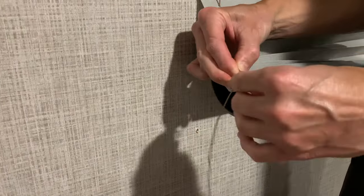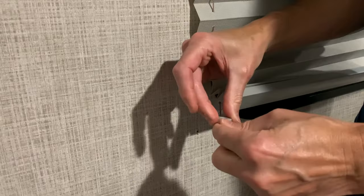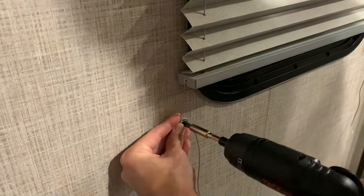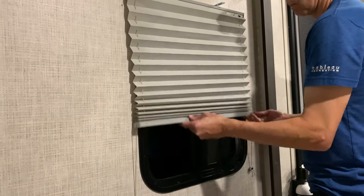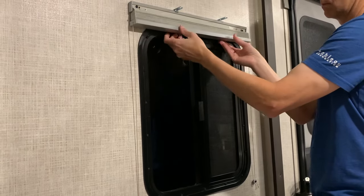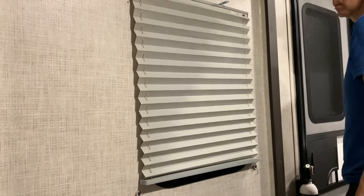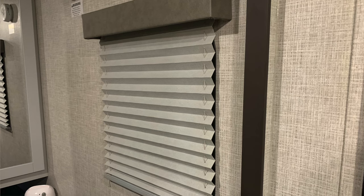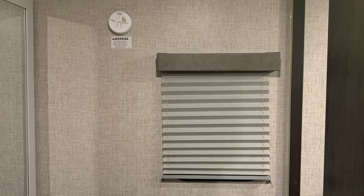You may have to move the shade up and down while holding the string taut to get the right tension. Once you have the proper tension, tie a double knot in the string on the low side of the tensioner so the string can't fall back through. Reattach the tensioner to the wall. If the tension is correct, the window shade should stop midway up the window without falling back down. Too much tension will make the shade difficult to move and will cause the string to fray more quickly. Finally, reattach the window valance on both sides using your Phillips screwdriver and the project should be complete.